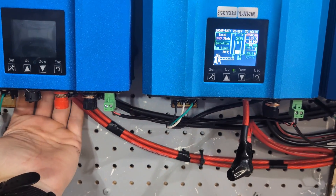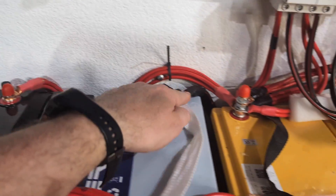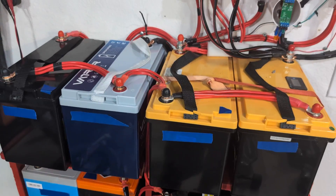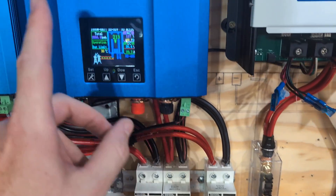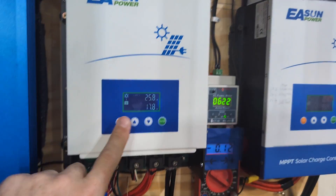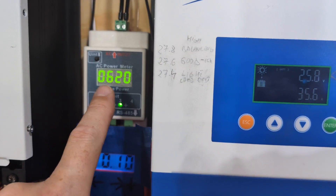I have extra cooling on top, with one fan pushing air behind them. I left an inch gap - very safe system at 24 volts. You could touch any of these terminals without worrying because voltage is what kills you. These charge controllers are 100 amps each, controlling the DC voltage into the inverters. Right now it's early morning so this one is doing 20 amps and this one is doing 35.